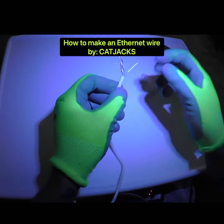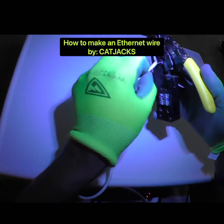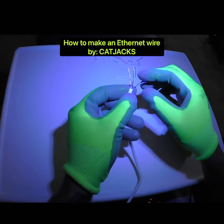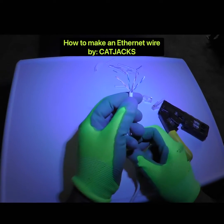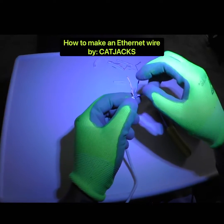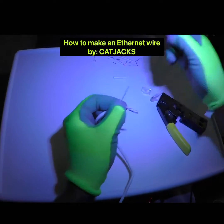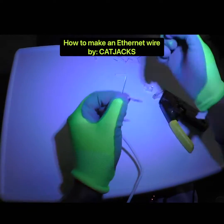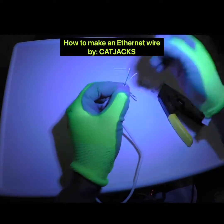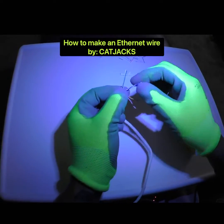Alright, then you have this little pull string on the inside. You want to go ahead and cut that too. And then you have your 4 pairs of wires. We need all of these wires, but first what we must do is untwist them. And while I'm untwisting them, I'm also straightening them by pulling from the bottom up. And while I'm doing this, I'm also putting them in the order that they're going to go in.